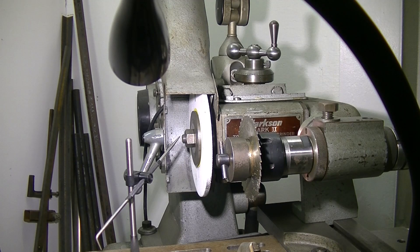The arc that the wheel is cutting will cut more on the heel of the land than at the front of the cutting edge, so the radius of the wheel creates the clearance behind the cutting edge to the correct amount set to the chart. This is also used on peripheral teeth of reamers etc. The Americans don't do a flat clearance grind — they do a concave clearance grind, and it works really really well. The chart is available in the Machinery's Handbook and usually comes with all the tool and cutter grinder manuals.